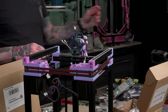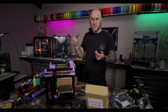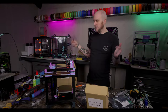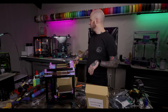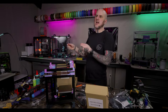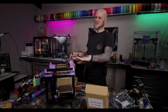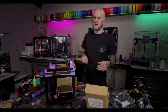You have to wait to cool too, that's a good point. Which totally ruins your chamber temps. Personally, what I do when I'm running parts continually on my 2.4, or any of my printers really, I will pop the tool, I'll take the PEI print sheet out, and I'll set it on top of the printer or on a bench, and then I'll immediately reheat the printer. So the heat stays in the chamber, the bed stays hot, and then the plate can cool. Multiple beds is the way to go, yeah. It still cools a little too rapidly, so ASA can warp a little bit when you do this, but it's great for, you know, crack it off the bed and keep going.